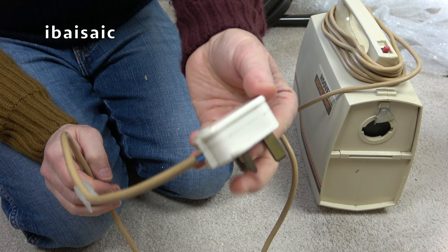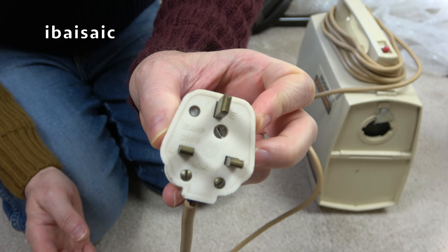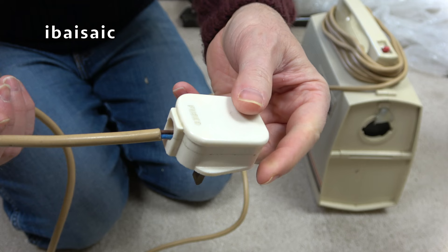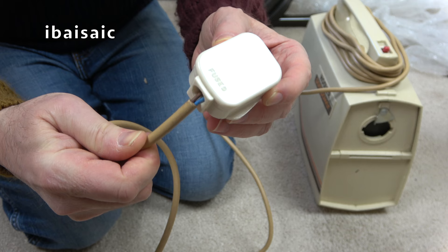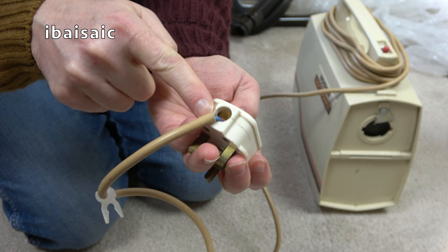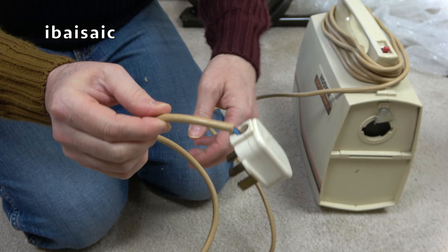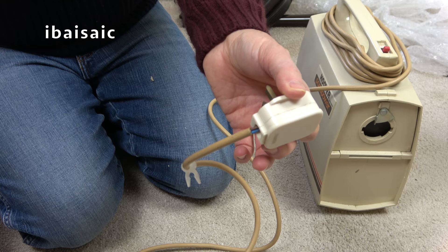I wonder what brand it is — it says 'HH' in a globe shape in the middle. When people wired up their own plug, you can see here the blue and the brown — the brown live wire and the blue neutral wire. When wiring a plug up, you're supposed to clamp the outer insulation of any mains cable underneath the cord clamp, not the inner. Because that's a quick tug and that could come loose and possibly give you a shock. I do quite like that plug — it's quite compact. I think I'll leave the plug on but wire it up a bit better off-camera before I switch on.